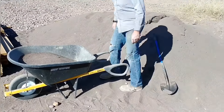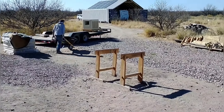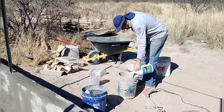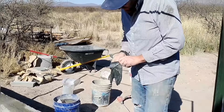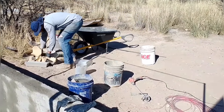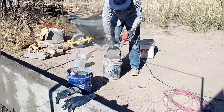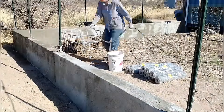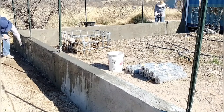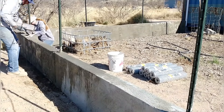I'm still using less sand than the typical recommended stucco mix, because we like having a little more cement for extra strength. We've settled on about two-part sand to one-part cement, whereas the normal stucco ratio would be more like four to five parts sand to one part cement. We're doing a higher-cement mixture because we feel the aircrete needs all the strength it can get. We started after lunch today and already have one wall done, moving along nicely on the second.